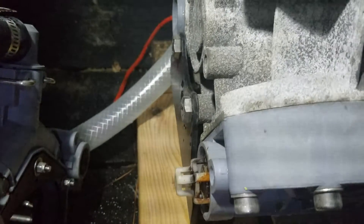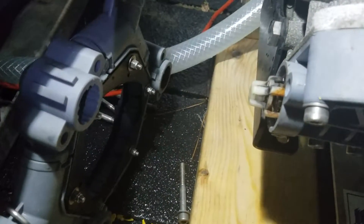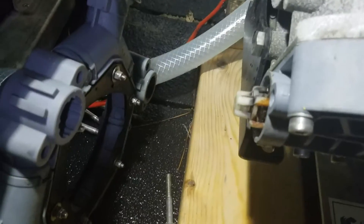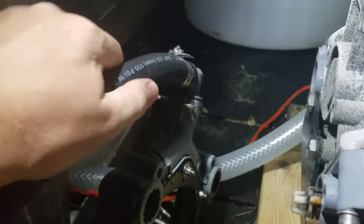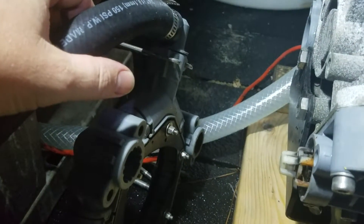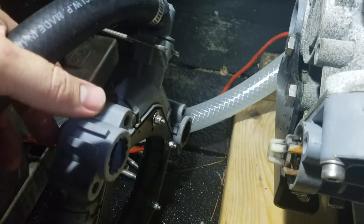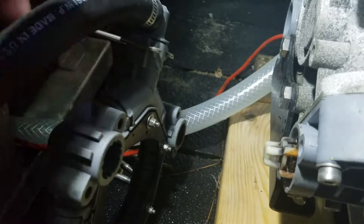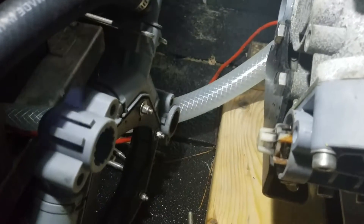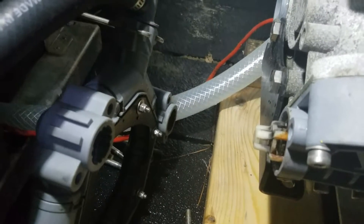These pumps aren't brand new but they're certainly not as frequently used as a lot of other pumps out there. I messed with the unloader to see if that was the issue, but this three-quarter inch line was pulsating pretty bad — same with the unloader bypass line. It didn't matter if we changed the speed or anything like that. Part of this I'm sure is lack of flushing, and Russ is also saying that cavitation could have caused it. We do try to pressurize pretty much the entire system.